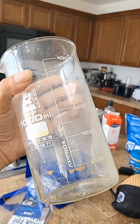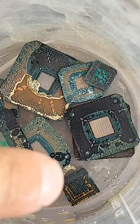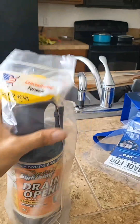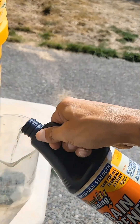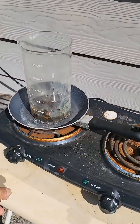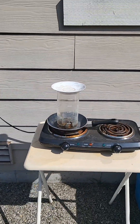All right, we need a dirty one-liter beaker. We're going to put the chips in the beaker. You can see some of the gold down there already — that's actually not the gold we're looking for but that's good too. All right, now we're going to take this outside. You should always wear gloves when doing that. We're just going to pour this in — it just needs to cover the chips. Maybe a little more. All right, so I got the beaker on my hot plate and I'm just going to turn it to low, cover this up, and let it do its thing and come back.